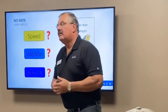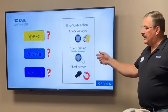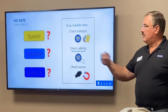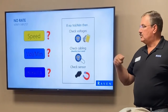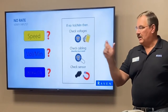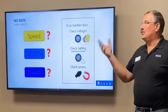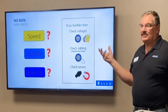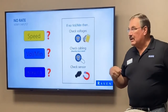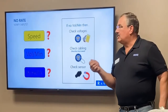While the sensor is still connected to the cable, take a magnet — remember, it's reading the magnets of the turbine going back and forth, north pole to south pole — and watch your total volume. Numbers should start counting up. We set meter cal to one because we can't do the electronic pulses as fast as the turbine spins, that's why we put it back to one.